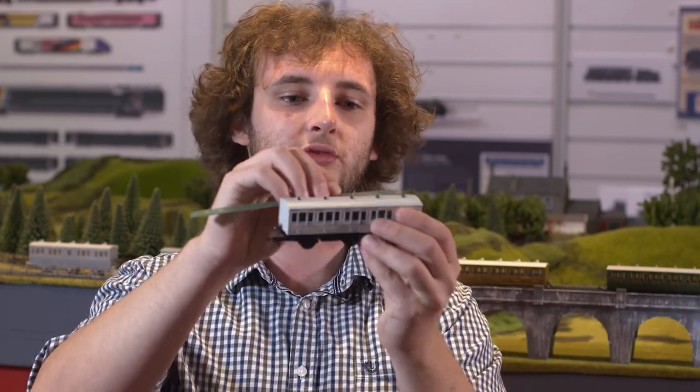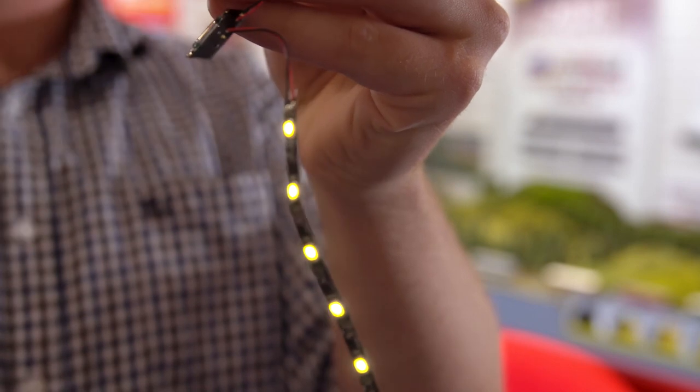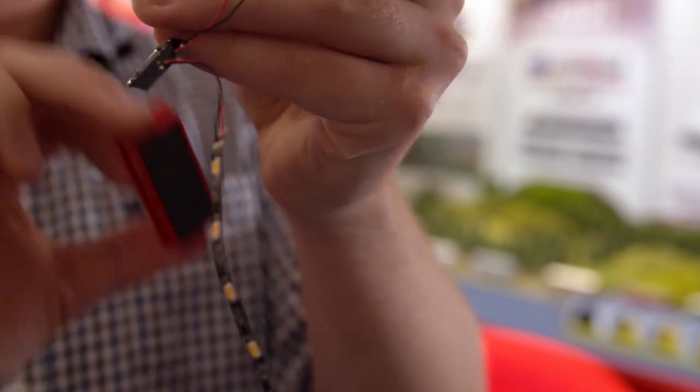The second big challenge we faced was the electronics. Traditionally we used fixed PCBs with a big capacitor on the end and pickups on the wheels, but because these coaches are so small, if we were to stick one of these in the roof you'd be able to see the capacitor through the windows. So that's when we developed the MagLite system — a flexible strip with tape on the back to retrofit into our coaches, with a reed switch on a PCB and a battery that sits underneath the seat unit. This is all controlled with our Hornby magnets, so when you wave the magnet over the roof the lights turn on. It's got a couple of advantages: we don't need pickups, there's a lot less drag on the coaches, so going around corners the Terrier — which is quite a small loco — will be able to pull more coaches in a rake.